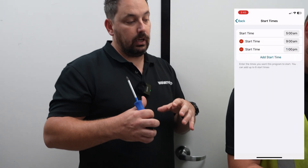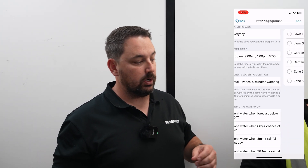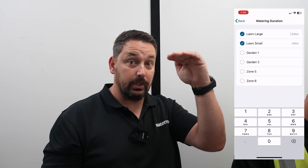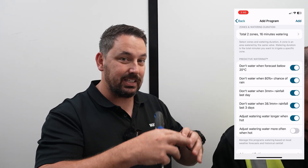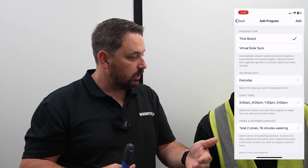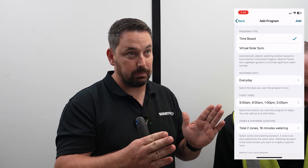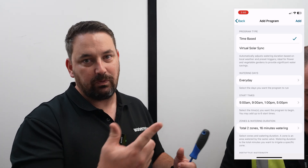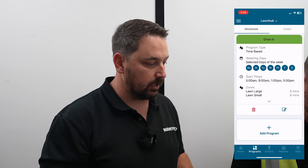One thing that comes up in a lot of phone calls we get through WaterPro is errors in controller system setups where someone says, 'My station's coming on three times.' What we tend to see is someone has put in three start times. It's important to know that start time one is the whole program coming on for its first start. Start time two is that exact same program coming on a second time. As Jonesy is doing here — he's set one at 9 a.m., one at 1 p.m., and one at 5 p.m. We also sometimes see people assume start time one is for station one and start time two is for station two — that's not the case. Gardens and lawns can get flooded because of that. Zones and programs are completely separate — reach out to us and we're happy to go through it.